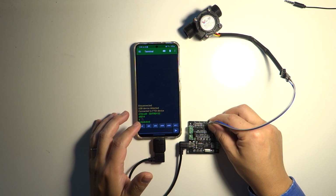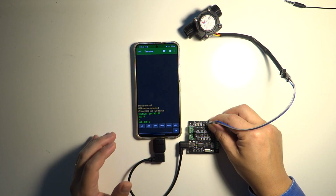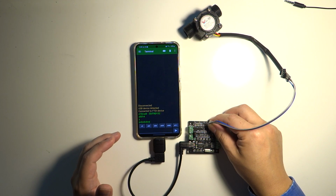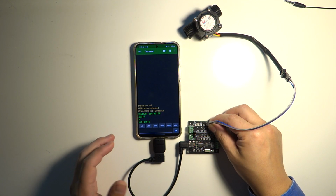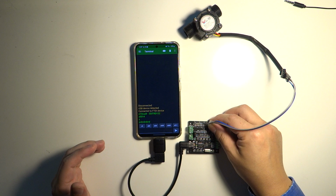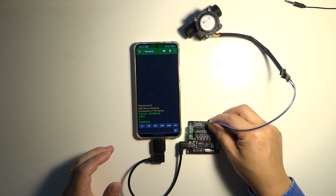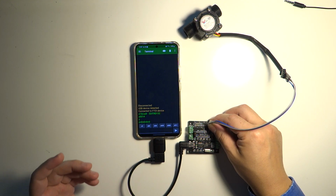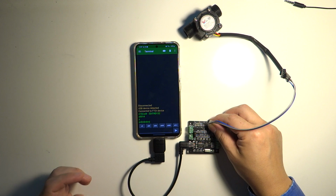And then if you have pulses, it'll show up on the next ZM9 reading, and after the reading, the pulses are reset to 0. So if you want to count how many pulses per minute, you can just send this command ZM9, and then do a ZD0, and that is the count since the last time you read it. And then in 1 minute, you repeat that ZM9 and ZD0, so it will give you the counts since the last readout, which was a minute ago. So if you time your reading, you'll be able to calculate pulses per minute, for example, like that.